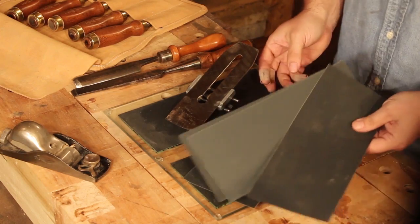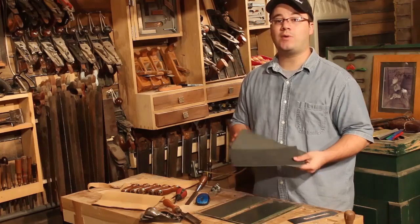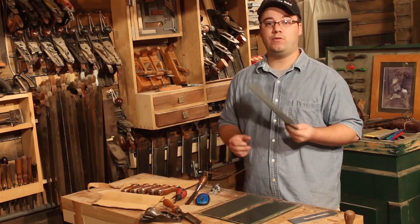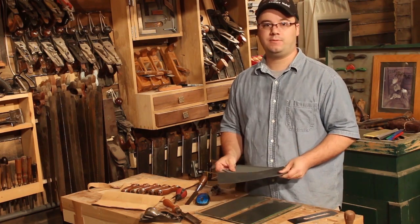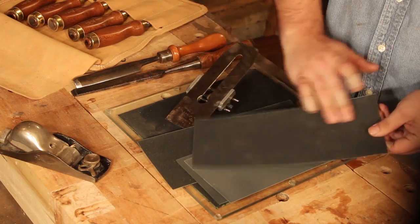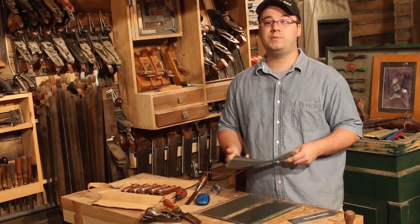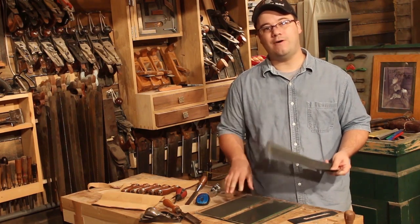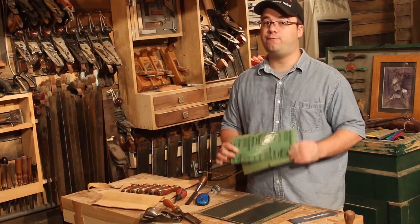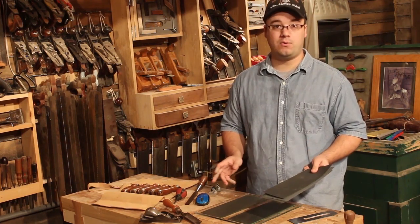Next comes the sandpaper, and this is the key to the Scary Sharp process. You have to have the right kind of paper, and this set comes with 4 grits of thick, durable silicon carbide strips. This isn't your typical hardware store sandpaper. It cuts tool steel faster and lasts much longer. And you get 2 strips of each grit, starting with an aggressive 220 and going up to a fine 600. They're big 4-inch wide pieces with a durable adhesive backing, so they aren't going to go anywhere.